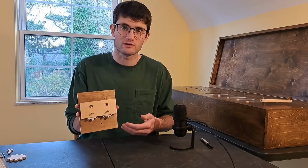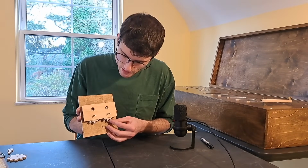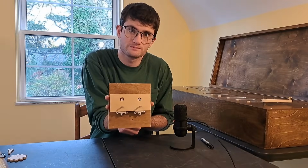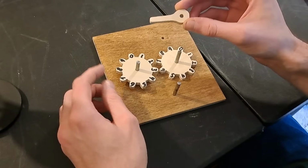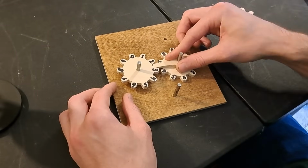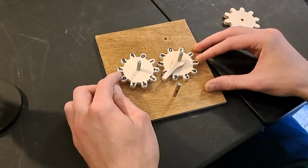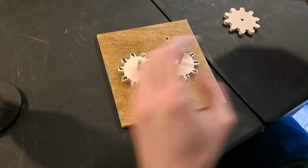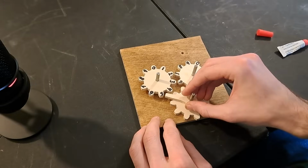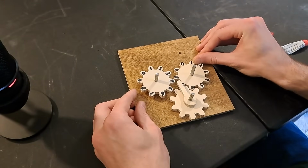After arranging the number wheels so that each one represents another decimal place, Pascal and Schickard only needed a way of carrying the 1, as we say. That is, when this one moves from 9 to 0, the next wheel over needs to move from 0 to 1, so that we get 10. In theory, this is easily done with this little lever or tooth that attaches to this wheel, but could nudge the next one along. But as you see, this would turn this in the wrong direction, so we need an intermediary gear. Now when I turn this one, it moves the other one just one tooth over.